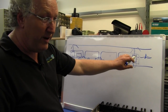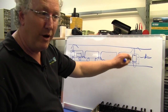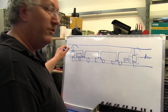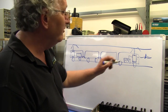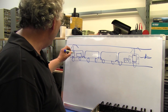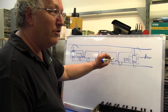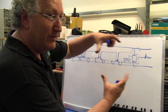It's going to transmit motor speed controls from that motor inverter down to this one down here, etc. There are public address signals that are circulated amongst the train. There are intercom signals so that a driver here can talk to a guard who might be resident in the guard's compartment down here. There's quite a lot of signals. I think there's 20 or more wires within these rather large connectors.